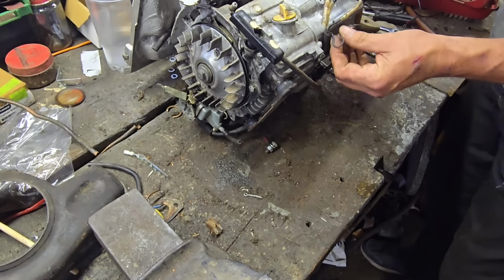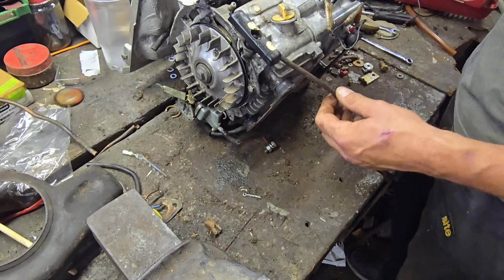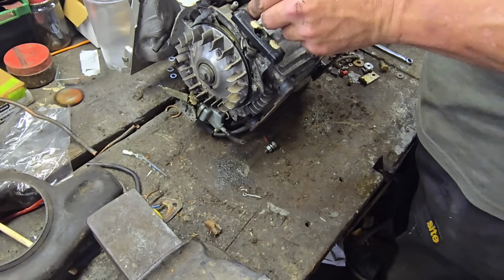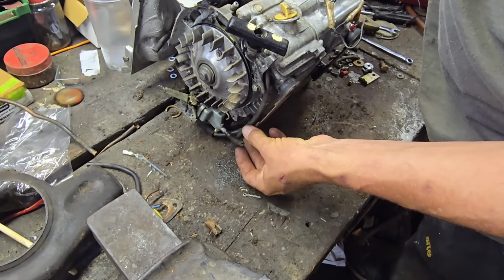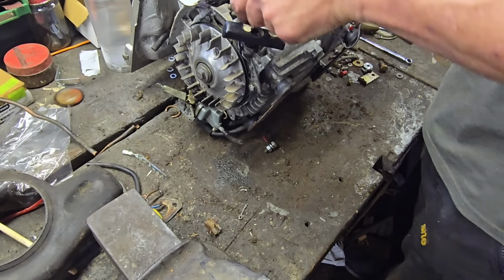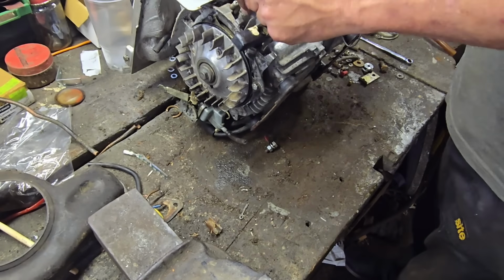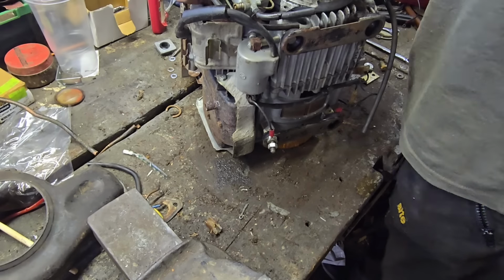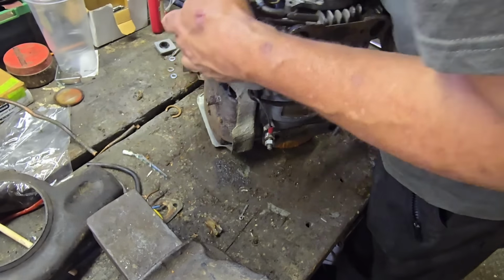Right, so them wires are clipped back there. This is a drain for the carburetor, I think. I think that's a... No, it isn't. Ah, no, that comes round. No, your fuel supply for your carb is there. This is your drain for your carb. So what's this one? It goes on to the petrol tap, and it's underneath there. What is this big pipe here? We've got a main feed. The feed pipe. Yep, our feed pipe is here.